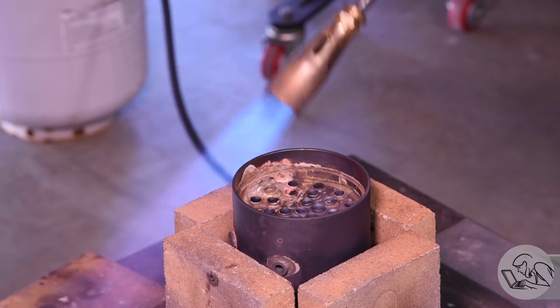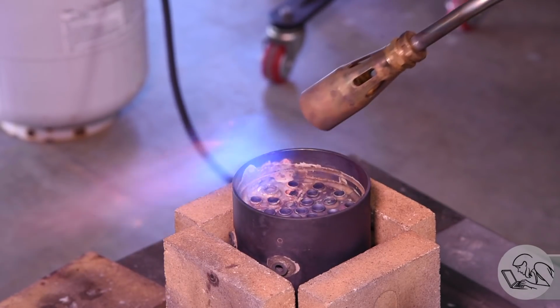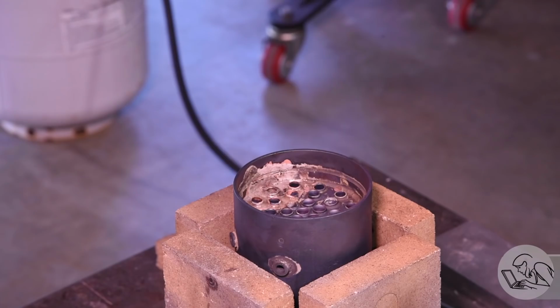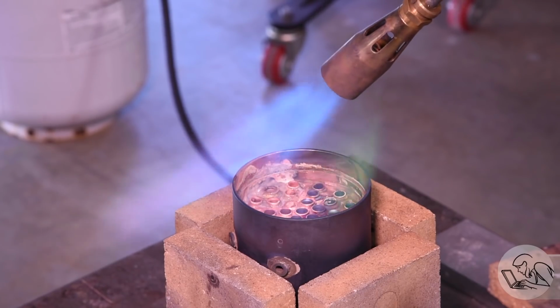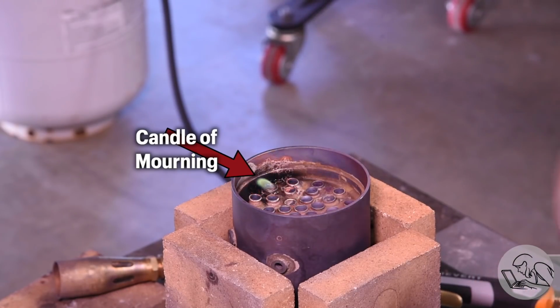So in this case, I had to switch back to the propane to finish the job, and once again heated up the whole tube sheet, and once again I created a couple of new tube failures. I tried all different methods of shielding the other tubes, and I tried cooling them down as slowly as possible with insulation and all sorts of things. I couldn't find any way to repair a tube that didn't cause another tube to fail. So this boiler was just about done.